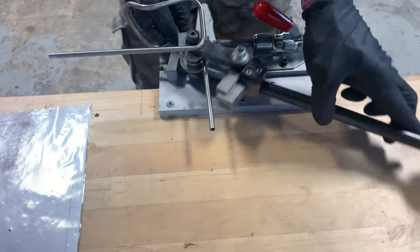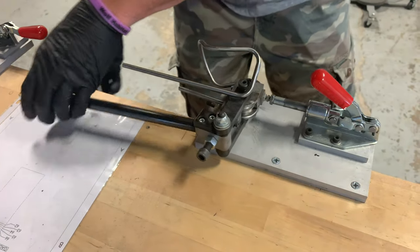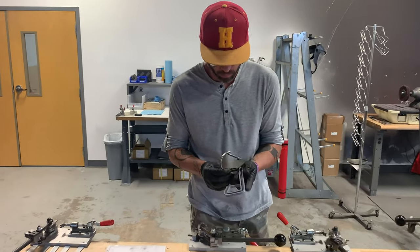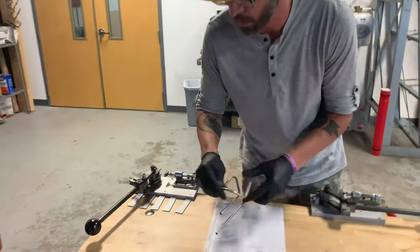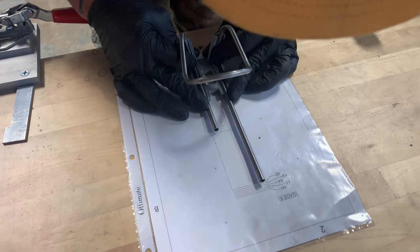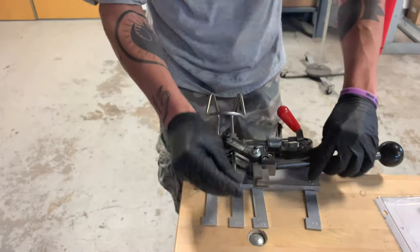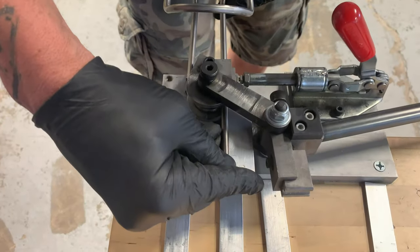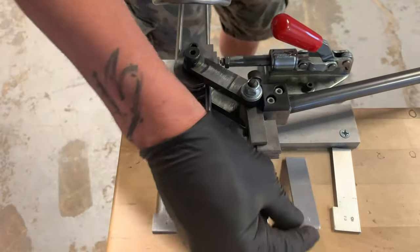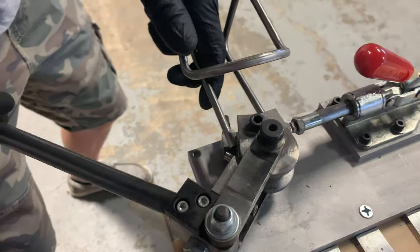The in-process quality control here is really important — not only to make sure everything is straight and aligned, but if you're repeating a process consistently and getting different results, that could point to a material problem or some other issue. We find it really important to gauge these at every step of the way. Because the tolerance is so tight at the end and there's no filler, every part gets checked and then fitted with a custom die to control the 180-degree bend. That's the hardest bend in the whole process, and sadly it's last — so it's where it's easiest to lose the tube.